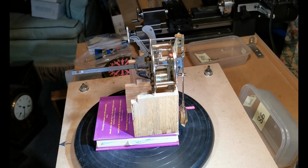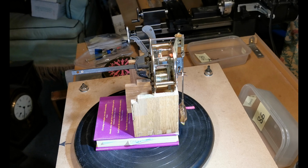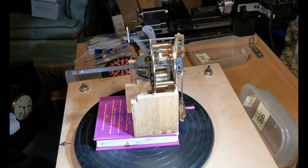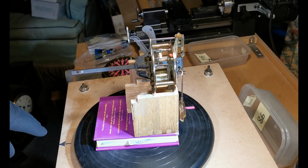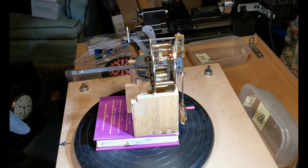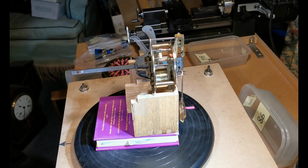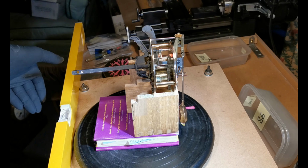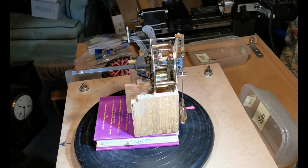Right, now the table upon which I put the clocks to test them is this table here, with an arrow pointing the direction it should be facing, because the surface upon which it's put is not level, and as a consequence, if I don't have this in the same orientation, then of course it's not going to be level. This is only level to the desk in this particular orientation. And this is so, that way and that way. So that means that I've got a dead right datum to work from, which is quite important.